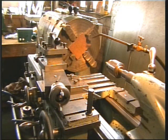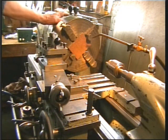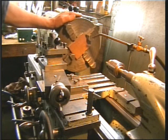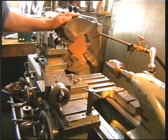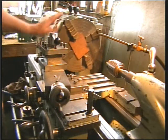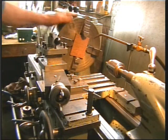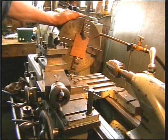Okay, today I hope to make the silencer for the engine. And here on my lathe, I've mounted the 12-inch four-jaw chuck. It's a massive lump, not an easy thing to do. And I'm making a flange here. I've reversed two of the jaws in order to make full use of the hollow spindle, as I want to put an 1¾-inch hole in the centre of this.